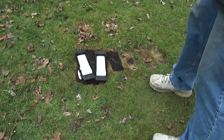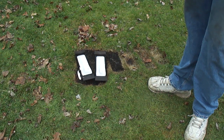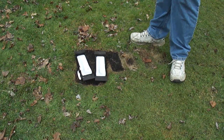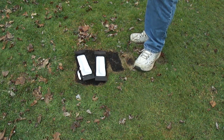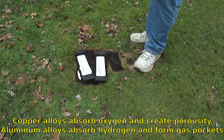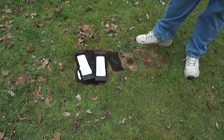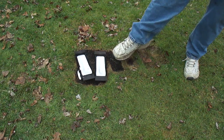Poured a little hotter than normal because I wanted that mold to fill, but that propane burner runs rich, which is no good for aluminum, so it does make it a little more gassy, but that's why I degassed twice. But it's really good for doing bronze and copper alloys because with it running rich, you won't have any porosity in the copper castings, or the bronze, brass, copper alloys. Aluminum you want oxidizing or neutral.